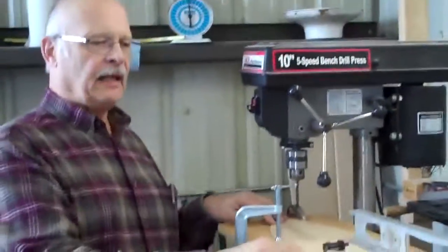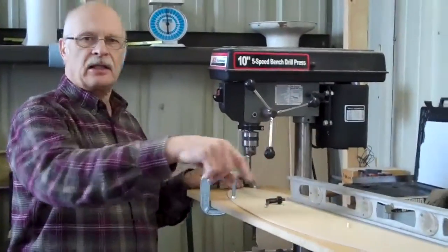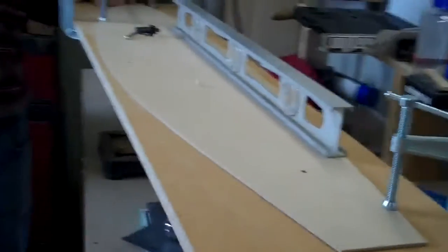So what are you working on here? I'm using this — John Burke machined out these on his CNC machine. It's exactly the outside surface of our wing when it's finished. We've got these holes that are right on the horizontal center line, so I'm drilling the holes in this board so I can put the board screwed on with the deck screws to the ends of this thing and make sure there's no twist in our wing section.